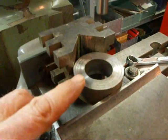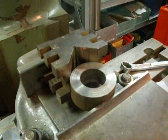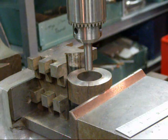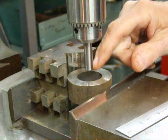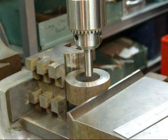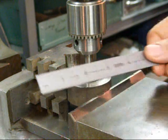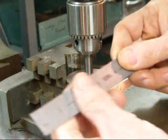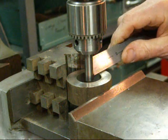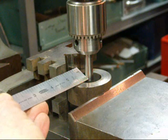So you don't need to tighten this very tight. If you have a thin-walled piece you may need to clamp it some other way. Now we're ready to indicate. The first thing you want to do is find the rough center of the hole. I put a three-eighths dowel pin in there, just in a three-jaw chuck, and I'm bringing that down into the hole and moving the table back and forth until it looks like it's approximately in the center. Then just with your six-inch scale, take a reading on all four sides — turning it back and forth — and it looks like it needs to be about three-eighths of an inch from each side in order to be in the approximate center.